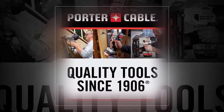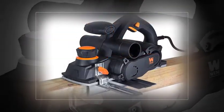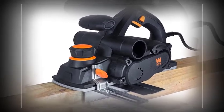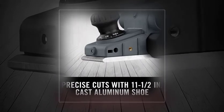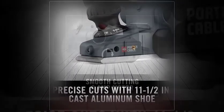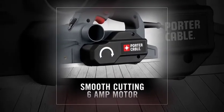Step 2. Shave off the high spots. First, mark all the high areas on the board with a lumber crayon. After that, use the power hand planer to shave off the high areas you marked. While you're at it, always cut along the wood grain. That way, your wood won't have a tear out or damage. Also, remember to use a straight edge to check your progress.